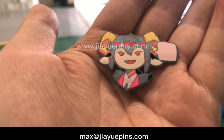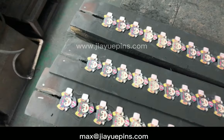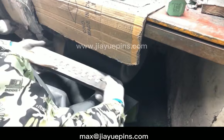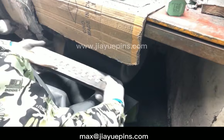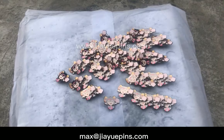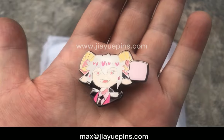After all colors are ready, the pins look like this. Then they are sent to the grinding machine for initial polishing, and then polished on the polishing wheel to make them shine. After polishing, the pins are sent for plating. These pins are required to be black nickel plated. The general idea is putting these pins into pools filled with black nickel liquid, then with the reaction of electrolysis, the positive ions of black nickel are attached on the surface of the metal pins. After plating, the pins look like this.